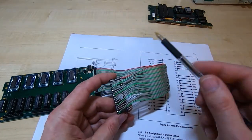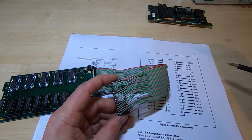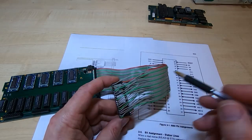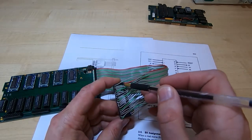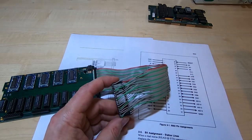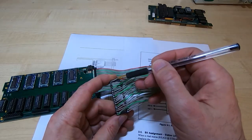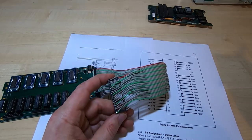As you can see, I have the red lead which is pin 1 connected to pin 40 on the header, and then conductor 2 goes to pin 1. Then you just alternate side to side — so the next conductor will go to here, the next to here, the next to here, and they just alternate back and forth. You just alternate the conductors from one side of the header to the next, then back, and you just keep going for all 40.